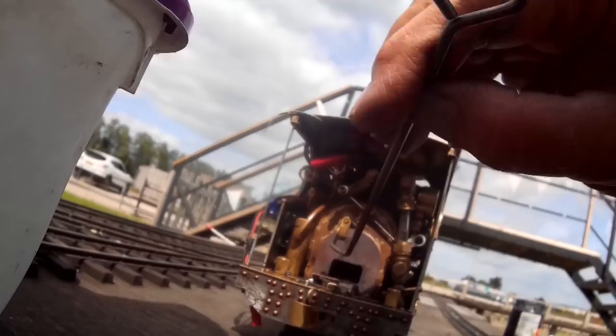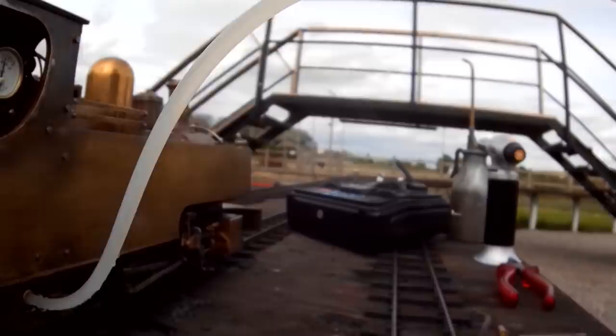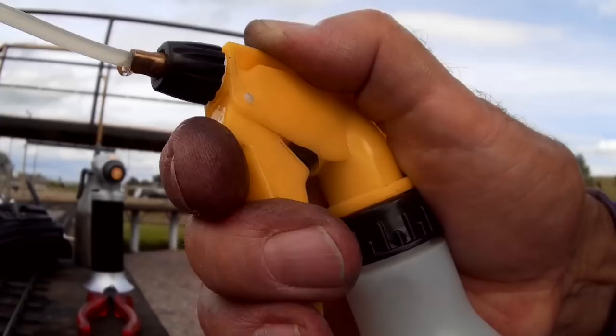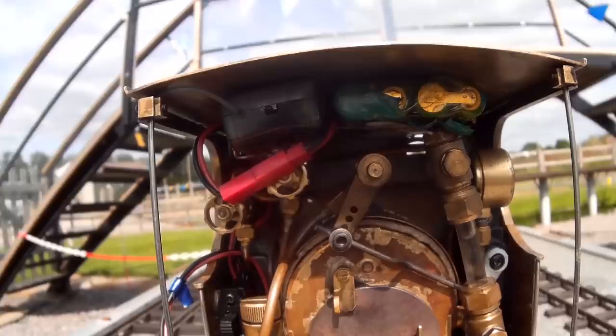Leveling the new fire, and because the engine has been stood for a while blowing off, I've got to get the pump plugged in and some water into the boiler. The water level's down to the bottom nut of the gauge glass. Pumping brings the water level up quite quickly, but I have to be careful not to reduce the pressure too much. If I do, the blower will lose its effectiveness and the fire will go out. Starting off again, the axle pump is well capable of keeping the water level up in the boiler.